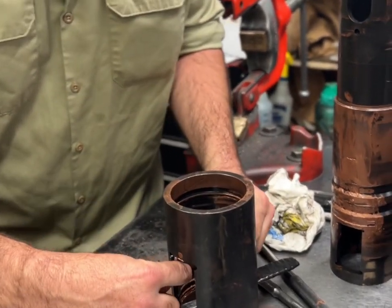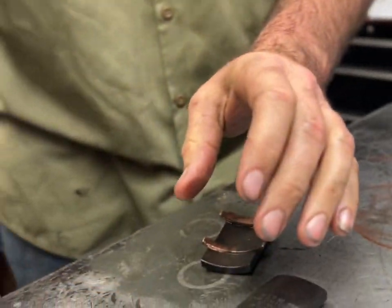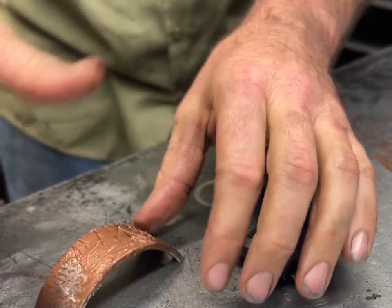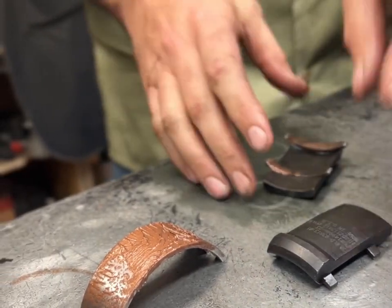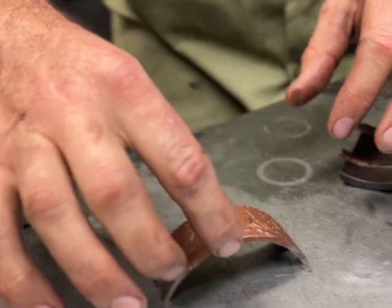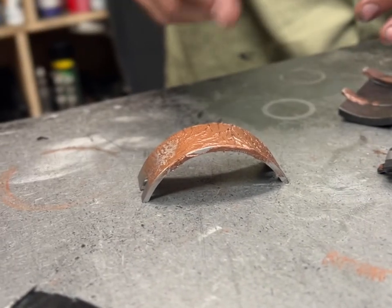Another thing I forgot to look out for with these is to put them on the table. Put them on a flat surface. If they rock, if they're twisted from the tool going down hole and being a little crooked, these can get twisted. To put this on the table, if it don't rock like this one, it's good. If it rocks, it's twisted, it needs to be replaced.